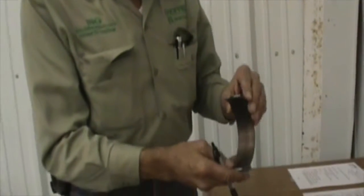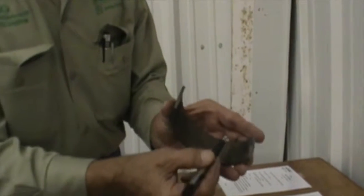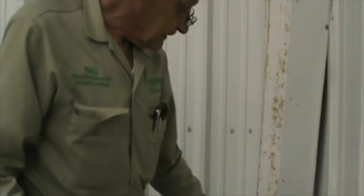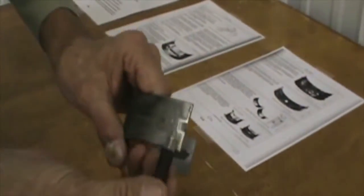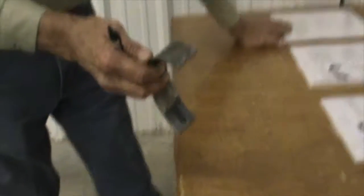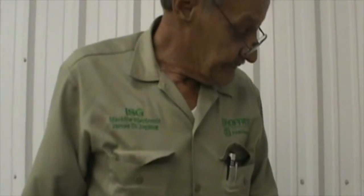The next question: is this likely caused by lack of lubrication? Yes. If you look at the failure charts, that is definite lack of lubrication because of the way it's worn — but it's worn equally, so we don't have tapered journal problems. Do they show to be installed correctly in the correct direction? Yes, because they've got little notches that they fit into. So that's correct. The last question: if it had starting issues such as dead batteries just before it failed, when they jump started, could it ground pass through and cause this damage? No, that wasn't due to electrical arc and ground passing.